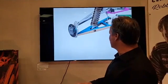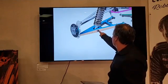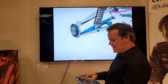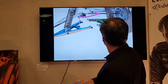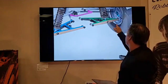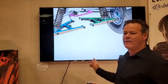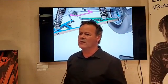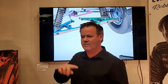We talked about A-arms. As you see, the shock is located in the middle, the anti-roll bar is located in the middle, and the rod end misalignment at the outside, as you'll see from this side, it allows us to switch over to the other side here where we can use the lower A-arm left and right. So as I said, lower A-arms left and right universal, upper A-arms left and right universal, trailing arms left and right, switch them back and forth.